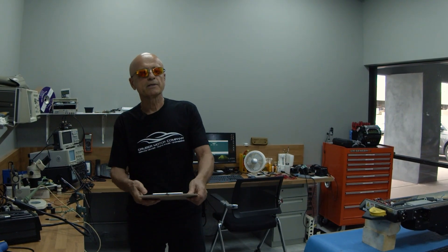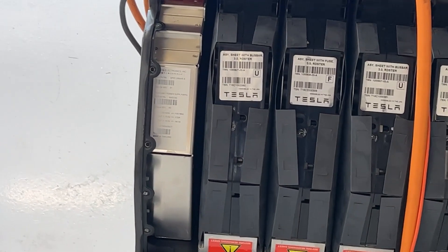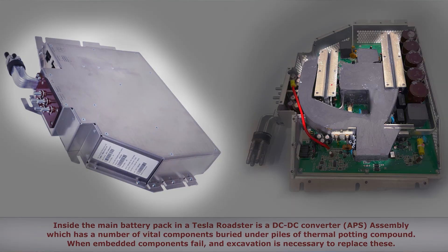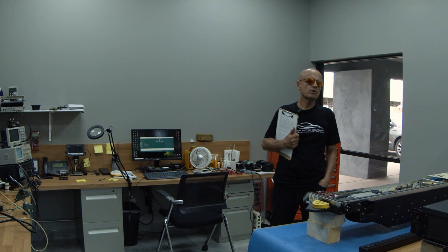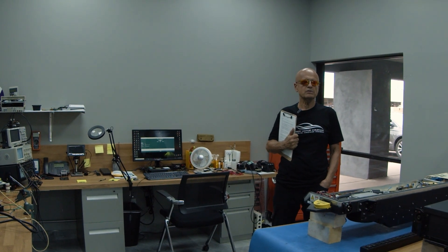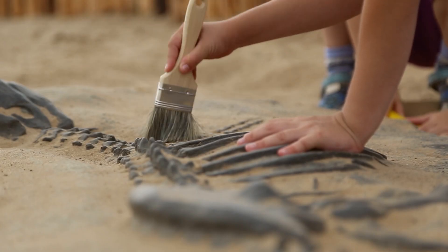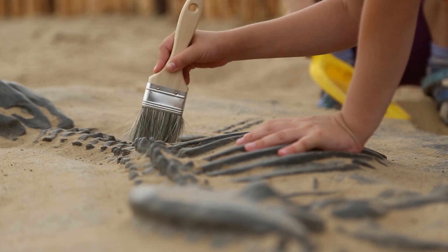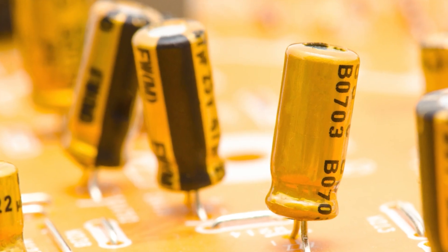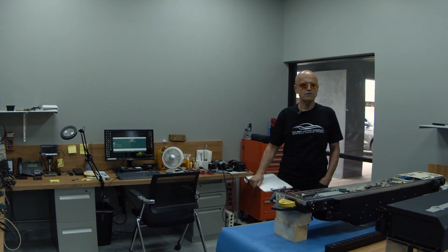Other sub-assemblies like the DC-to-DC converter and the Tesla Roadster battery pack are also partially potted, burying vital and serviceable components. Our repair of these sub-assemblies — out of production since 2008 — is like an archaeological dig, where we have to excavate MOSFET transistors, transformers, capacitors, and other components as they fail.